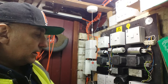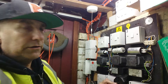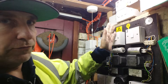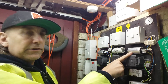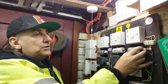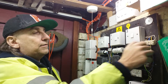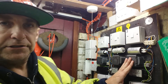The mains comes in by a cutout down the bottom here that services all three units. We start with the switch to switch the lamp on and off, then we have the capacitor — the silver tubular component there — which is for smoothing out the voltage and helping out any ripples in the power supply.